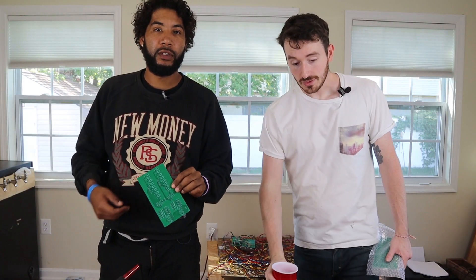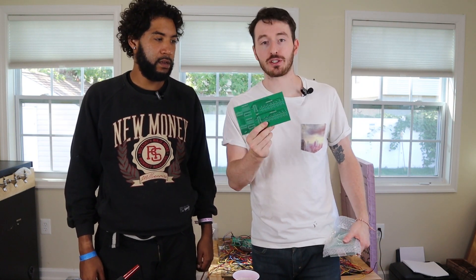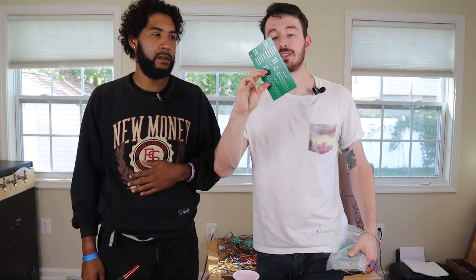The sweatshop, starring Tyler and Gig. We just printed these PCBs out. There were some errors in the first version — I fixed them for the second version, but the errors can be bypassed by doing some workarounds we're going to do now. I forgot to add a power port — power in and power out — and I also forgot to add a daisy chain out. But we can just take the back and solder them, so that's probably what we're going to do.